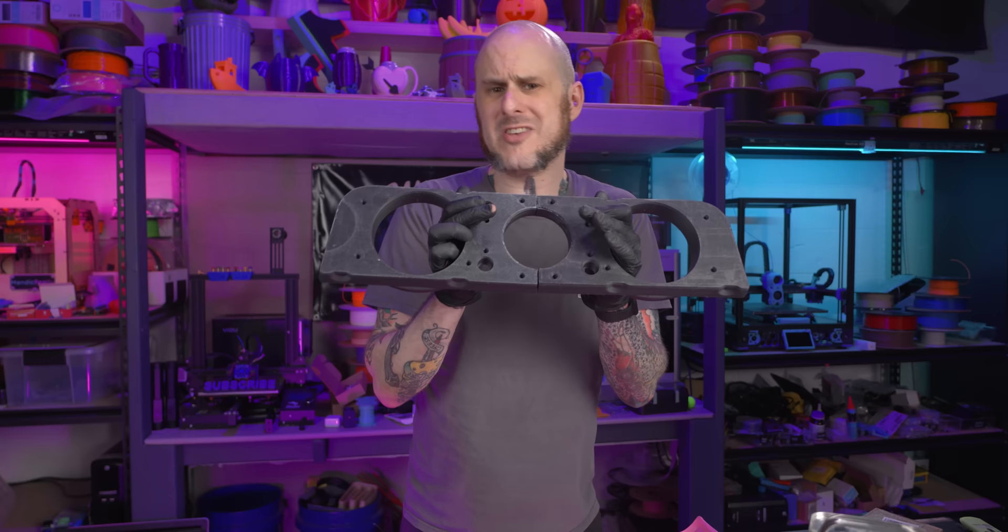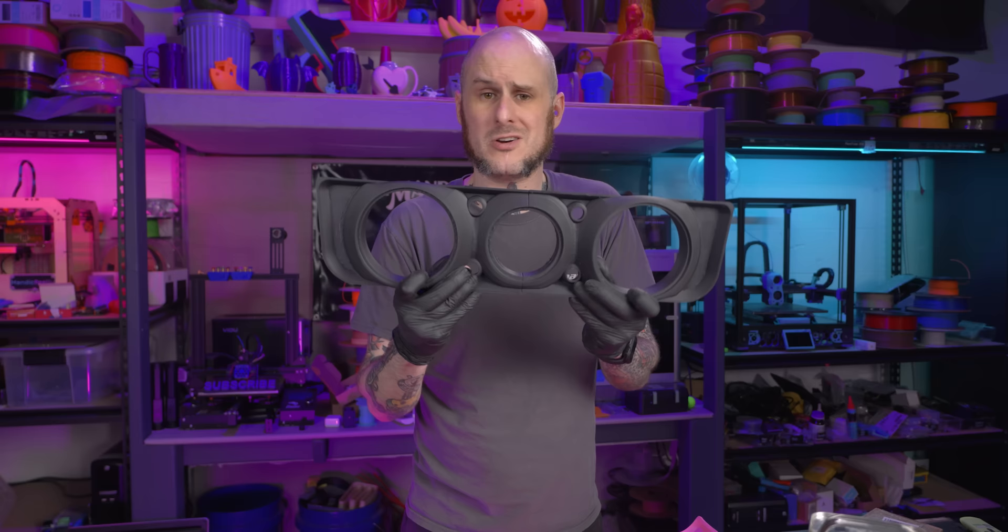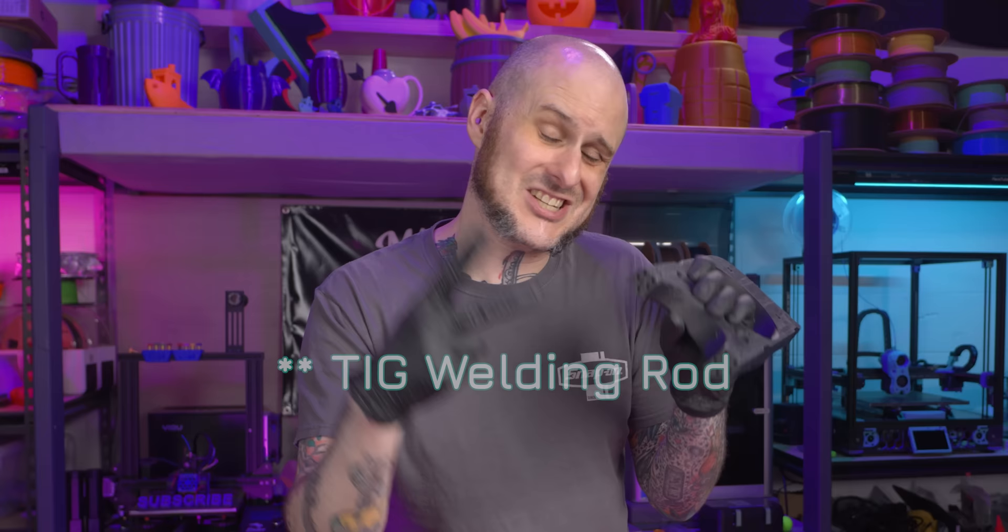Now we are gathered here today to join these two halves of this cluster together. It was made in two pieces because the overall length is just over 500mm, so no machine I currently have would fit this into its build volume, especially printing it in a material like ASA. To make my life easier putting this together, I put dowel holes in the ends of each of the halves, so I'm going to stick some 1/8-inch TIG rod into there to use for alignment and strengthening the joint.